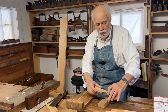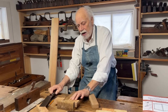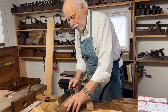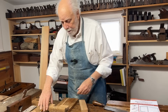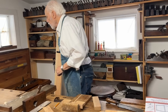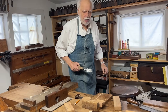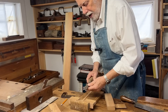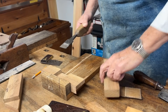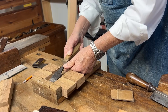I then put the second piece of wood on here, scribe its width, and do exactly the same thing — putting the saw in the kerf the saw made, sawing down all the way across several times. At this point, if I've been careful to only saw down to the scribed line, it's a relatively easy thing to take any convenient chisel and, using the bench hook with the bevel down, clean out the waste. The multiple cuts tend to come out perfectly smooth anyway.